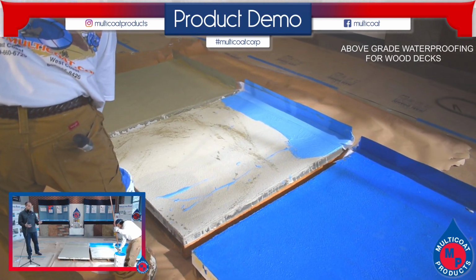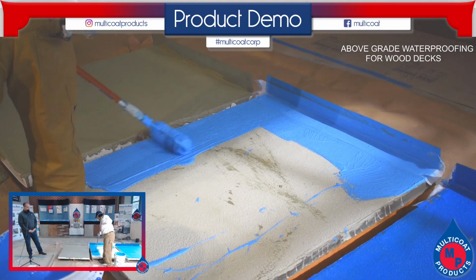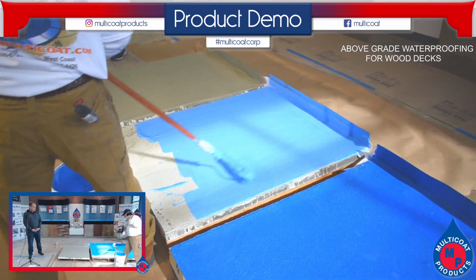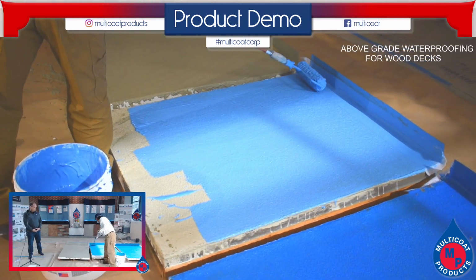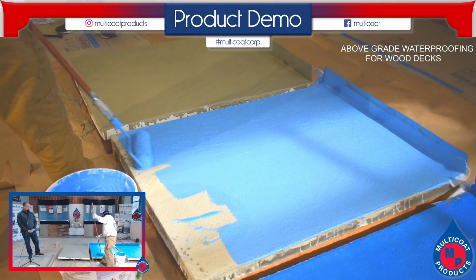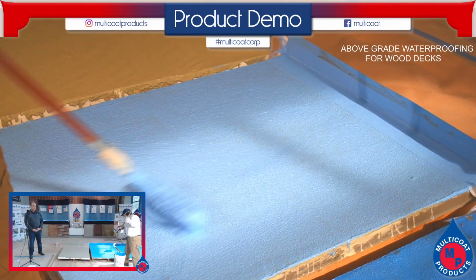Again, the Multicoat almost has no odor. Again, low VOC. For this 2-coat application, you'll get 250 square feet per 5-gallon bucket. Easy to roll. If you happen to get it on your hands, come up with soap and water, and once it's dry, it won't come off. If you've tried other deck systems, I believe we're very price competitive. We have our product in stock at many distributors around the country. So it's local. We have it in stock on the Hawaiian Islands.